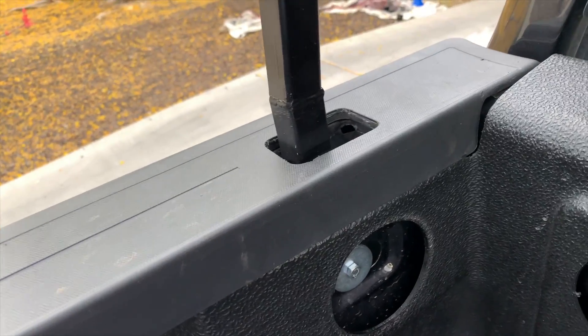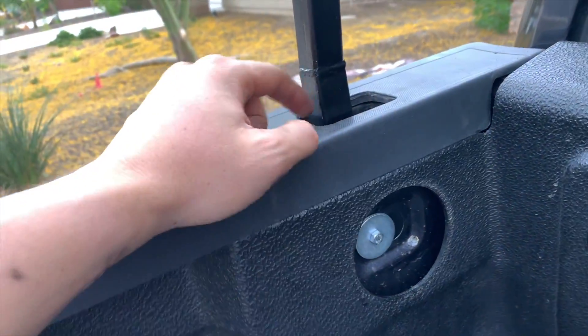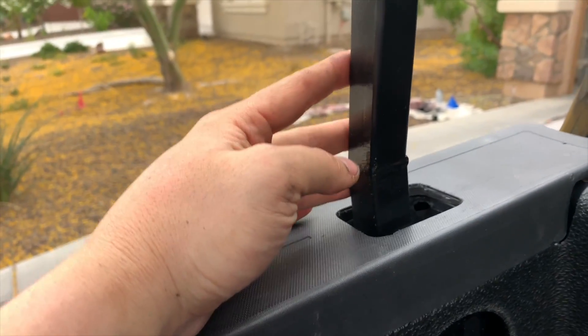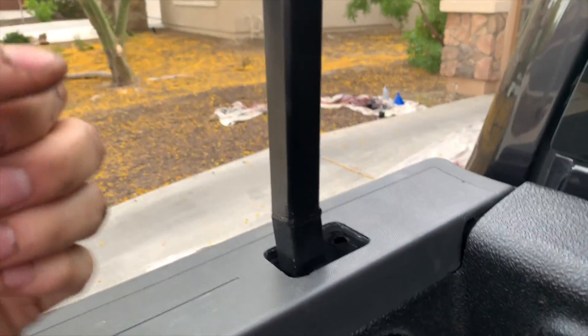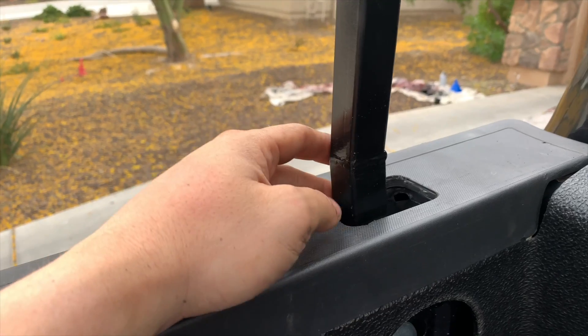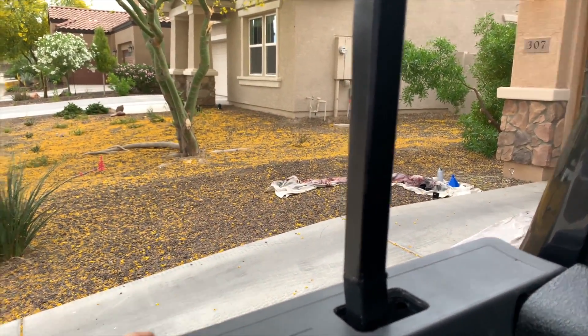I've just started bolting the rack onto the truck. I'm not even sure it really needs linchpins on the sides, because if you intentionally misalign the brackets I made inside — just painted them black and bolted them directly onto the truck bed — and put them in at a slight angle when dropping in the rack, they'll just friction fit. You squeeze it a little bit, slide it down, and that natural tension pushes against the side and seats it pretty firm. When you want to pull it out, you just stand on the truck bed, push it in a little bit, and pop it out. So I'm not really even sure I need to put pins in the side — it's really nice if it just friction fits in safely without any additional modifications.